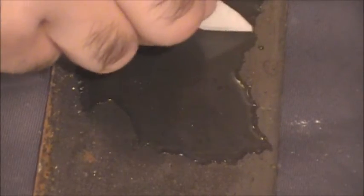Now let's turn this around and test for water. I'll put a little water on there — you can see that wet spot. Now the soapstone barely makes a mark through the water. And then the Silverstreak makes a much more dramatic mark. One swipe of the soapstone through the water and it's completely gone. Three swipes of the Markall, then dab the water off — and that Markall line is still visible, while the soapstone mark is not there at all.